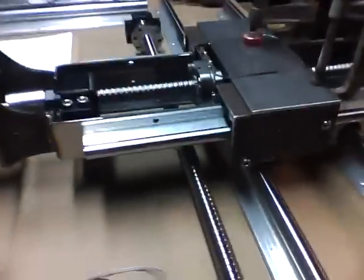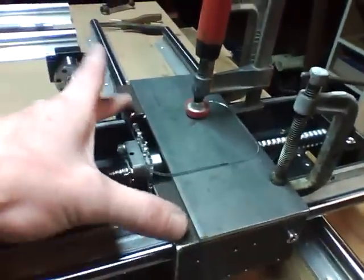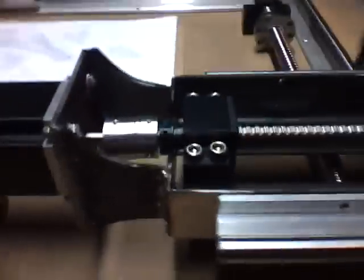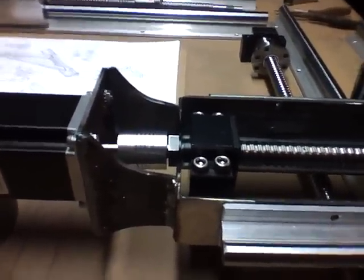Let's get to the good stuff. I made an acrylic plate attached to a little nut, clamped it on. There's a plate here clamped to the two L brackets that are on the glides — sort of what it'll be like when it's done. I've got a G-code feeder over here, an Arduino motor controller, and a power supply. I'm going to stick X0 and see if we're centered or not — we are not. I've got it going extraordinarily slow so I can watch it go.